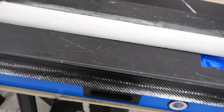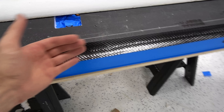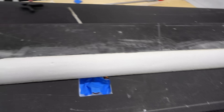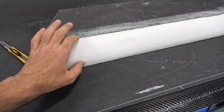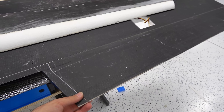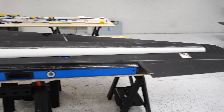This will add strength to the wing — it connects both skins and it becomes like a bar going across the wing. Anyways, this is done. It looks nice. This corner is very clean, you can see the profile. That's the flap, and it's sanded and ready. I'm just waiting for this to cure, it's still a bit tacky. I want to also cover this — I think it just needs a thin layer of fiberglass, no carbon needed. Then I will put four hinges in here. This is the aileron. These hinges work really nicely here. This is looking really good.